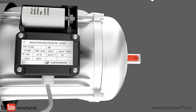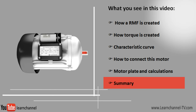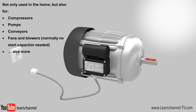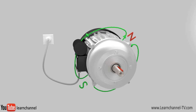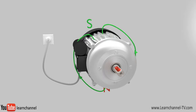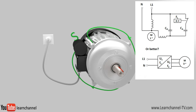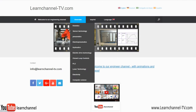Further information about your motor can be obtained from the datasheet. The capacitor motor can be classified as asynchronous, AC, and induction motor. It is a rather robust motor, but the weak points are the capacitor and the speed switch if you have a starting capacitor. Because electronics are becoming more and more powerful and cheap, big single-phase induction motors are replaced more and more by three-phase induction motors controlled by a VFD. You should know that small VFDs can be connected to single-phase voltage. For more information about electric motors, please visit our webpage and subscribe to our channel.